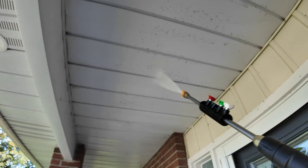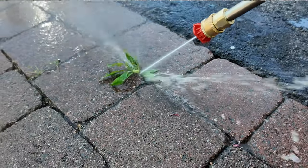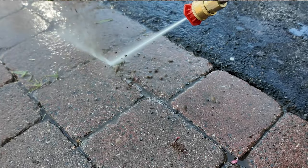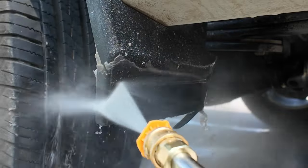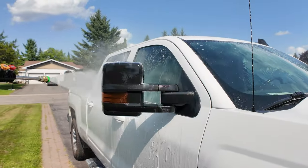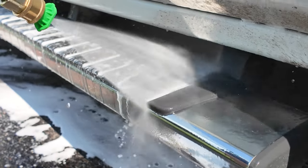With this wide range of pressures and patterns, it makes this unit suitable for various cleaning tasks. You can see the zero degree nozzle is perfect for cutting down those pesky weeds in your patio — just be sure to watch out for the flying mud. The 15 to 25 degree covers your main cleaning projects, while the 40 degree nozzle is great for a gentle rinse over a car body and windows. This range of nozzles makes it easy to customize your cleaning approach.